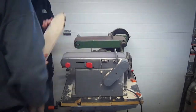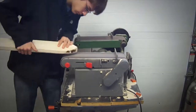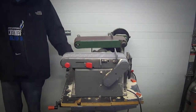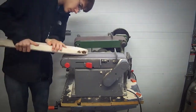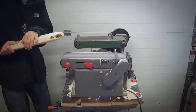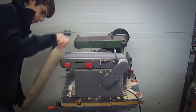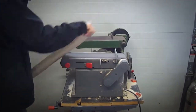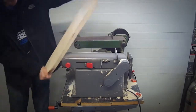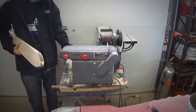At the very tip it'll taper down as well. I'm trying to work on a lot of it equally, moving it around a lot, and staying off that wheel as much as possible unless I'm going up and down the edge on the side of the sander. Also make sure you have at least a decent belt for your belt sander — that keeps it from burning the wood and removes material efficiently.